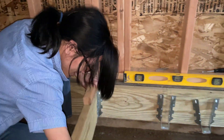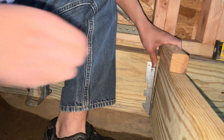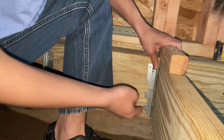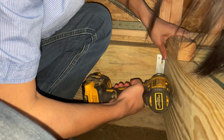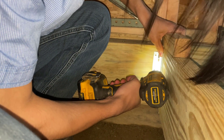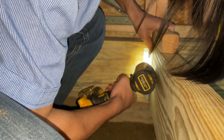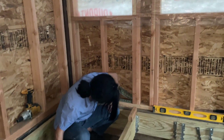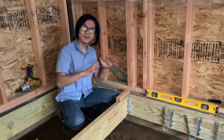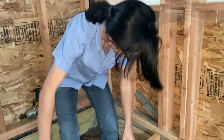We're going to take the second screw. We don't have to knock this side in again because the point of that pin was only to temporarily secure it while we put the first screw in. We just have to put the second screw on. Now we have the joist hanger in place. The ultimate test is to take off the template beam and put an actual beam on to see if it is flush.